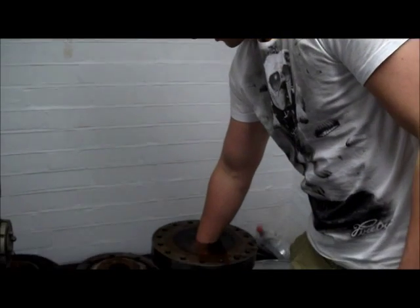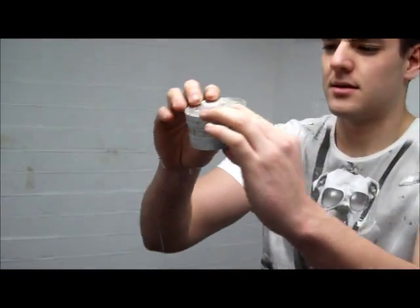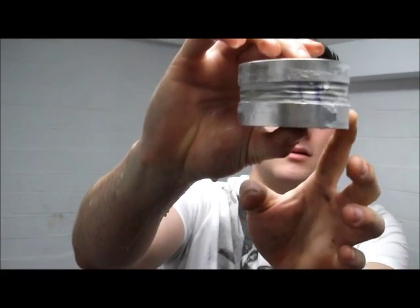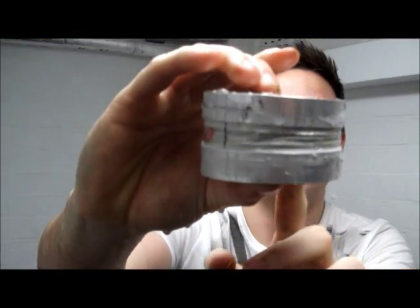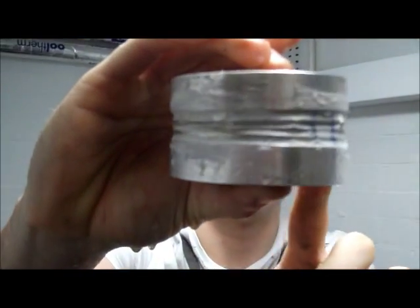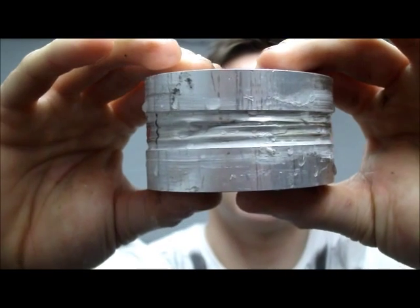Pressure fell to 35, then 30. Joe is now going to put his hand into the crystal clear water and remove the vessel. Has it collapsed? Only slightly — oh yes. This is a short model and it looks like it's collapsed axisymmetrically, but short models generally do.